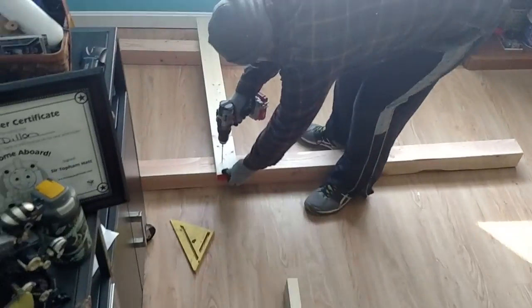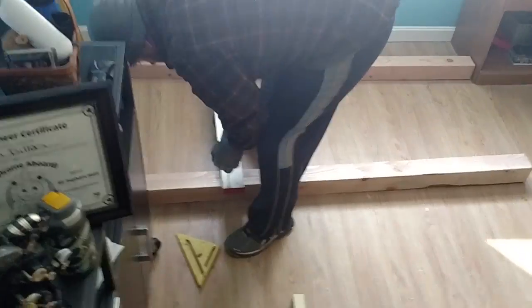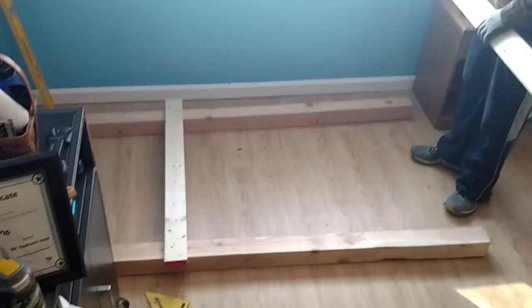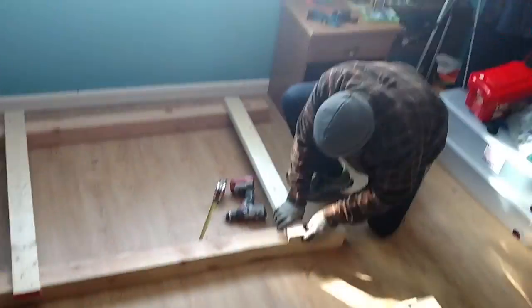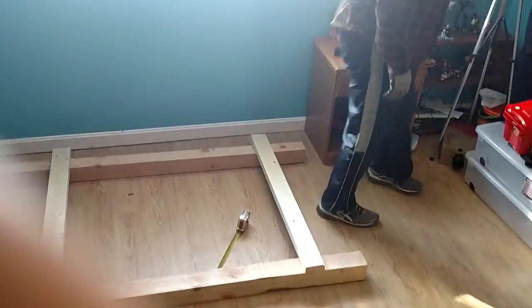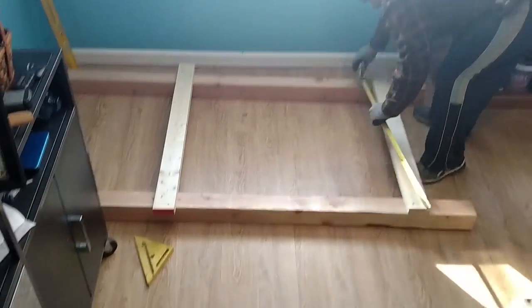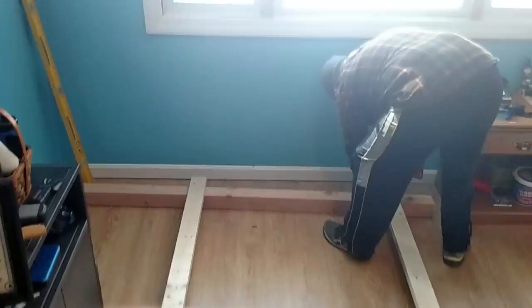Here I lay out the posts on the floor. They're cut to length and planed on all four sides. I screwed on the top and lower brace — measured, I think they were about 40 to 42 inches roughly, but again I'll have plans available at some point. I'll probably draw plans for both the bed I did for my younger son and this one, in case you have a corner to put it in or just one wall. So I screw those boards on, stand it up, make sure everything looks good, screw them in — ready to go.